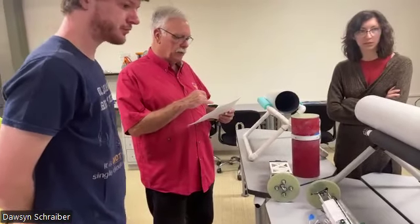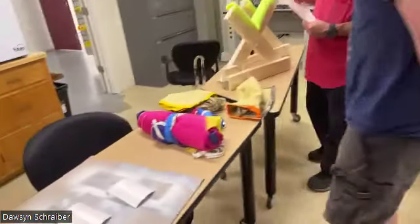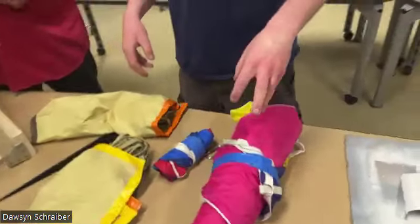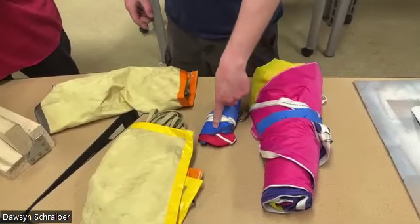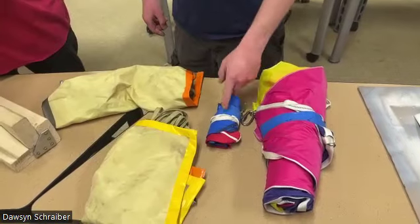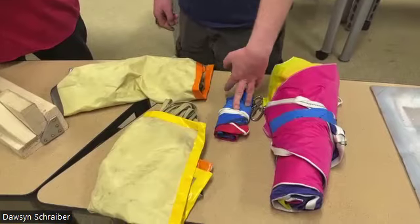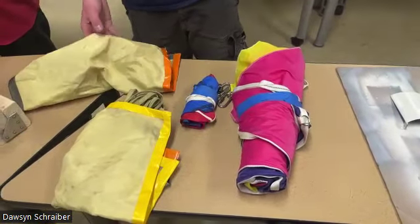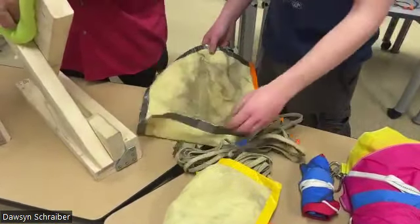Let's go to recovery. You want to talk about parachutes and software? Yes, length and materials. So over here, we've got our main parachutes. Main parachute is a Sky Angle Cert 3 single XL. Drogue is a Recon, I think it's a Wildman parachute. This one is 30-inch. This slows it down to 82 feet per second. This will slow it down to 17 for ground hit. We protect the parachutes with these 18-inch Kevlar blankets. You see this one's been tested.